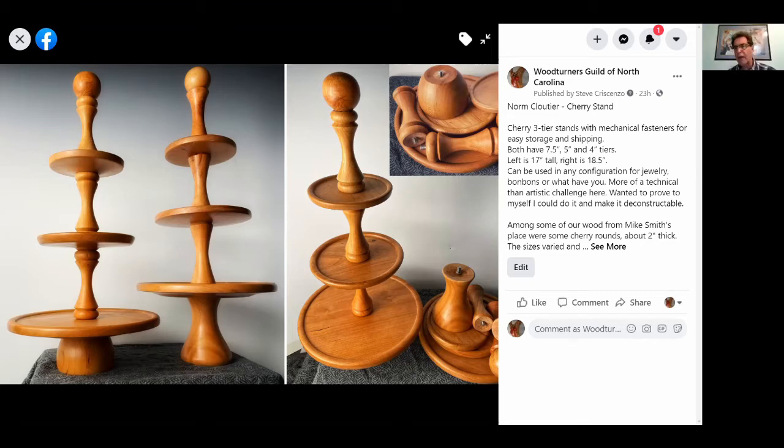Norm, can you tell us a little about that jig to get things squared up? So I just took a waste block that fits in my chuck, and I drilled and fed one of the threaded rods in. It was so tight that I actually had to hammer the thread rod in. I could turn it a couple times, then I hammered it in. Made sure it was dead straight, put a little CA glue, sunk it enough so that I could put a washer and put a little CA glue against the washer so that as I twisted things on and off, I wouldn't screw it out of the wood. But it just gave me a flat plane with the screw coming out of it. Then everything else was screwed and mounted as I went along.